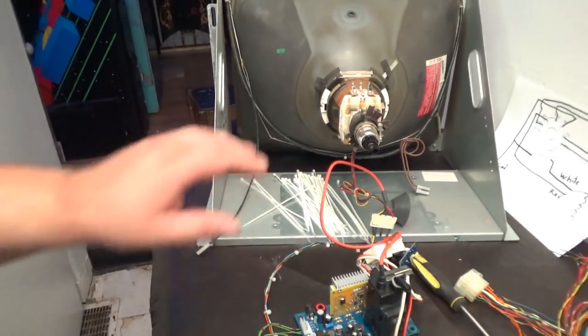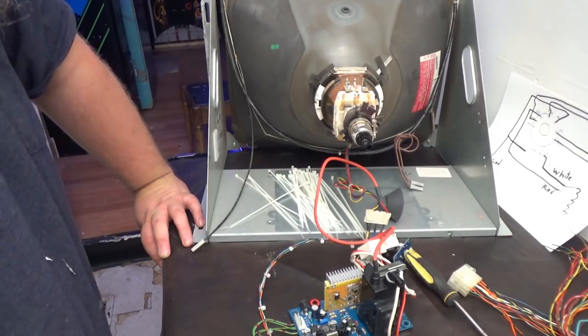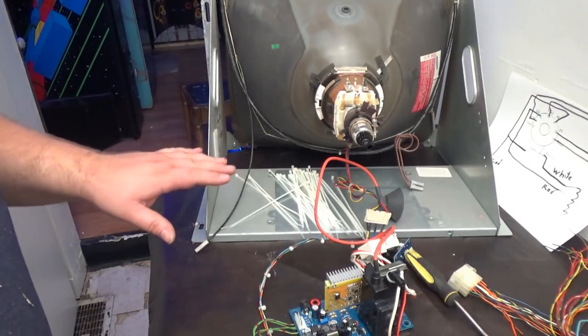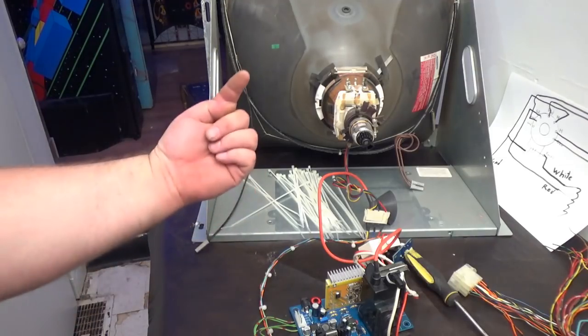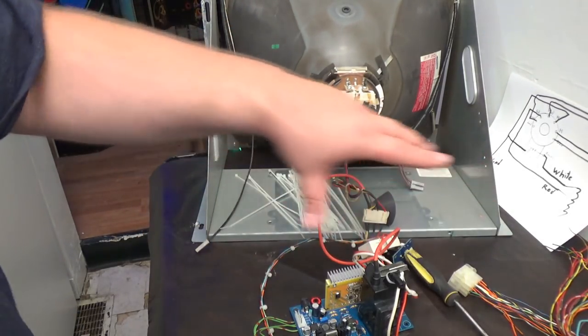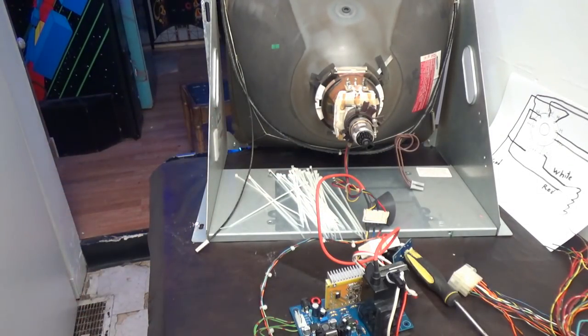Now I have plenty of room to position this. I'm going to use this monitor frame — this is a 19VK 1972 chassis, and I'm going to rewind this yoke for use with vectors. What I'm going to do is cut a piece of wood and lay it right over this steel. I'll screw from the bottom up into the wood through the existing four holes, so I have a big piece of wood I can easily mount these components wherever it feels right — no drill needed.